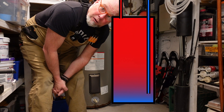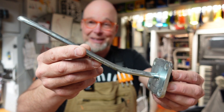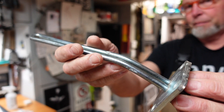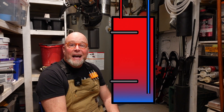But just what heats your water? In most cases, if it's electrical and a conventional 40 or 60 gallon tank, this is accomplished by heating elements inside the tank. These come in several shapes and sizes — here's a new element and here's a crusty old element. They basically consist of a metal sheath encasing a resistance wire, typically nichrome, surrounded by electrical insulation like magnesium oxide. Nichrome is the same metal which grills your toast, and magnesium oxide is sometimes known as magnesia, the dietary supplement. Sometimes the metal sheath becomes damaged, perhaps through corrosion, allowing water to seep in — and that's the end of that heating element.